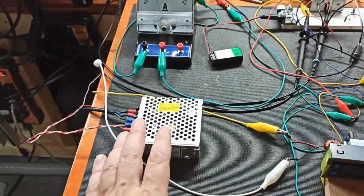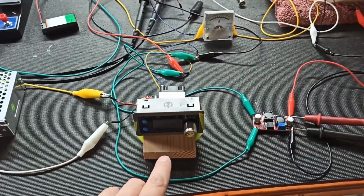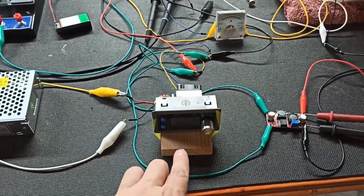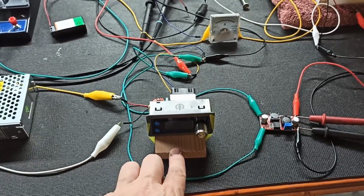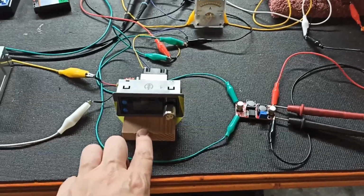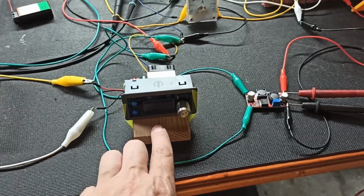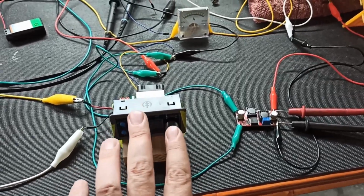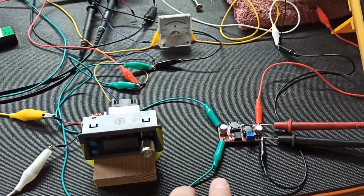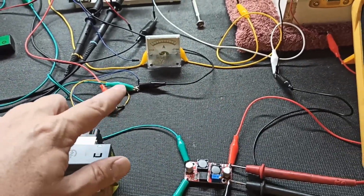So that's not good. So I have this DC to DC converter, and this allows me to set it at a specific voltage and a specific current, so it won't go above a certain current. It'll run up to whatever voltage it can, but the current will be the limiting factor in that. So this is current controlled. However, out of this guy, I then need two things powered. One thing is it comes down these lines from here on all these splits.